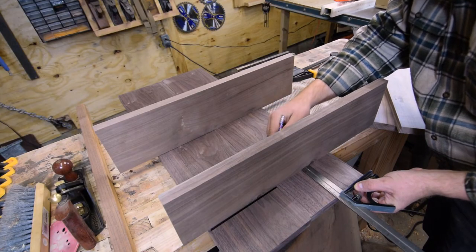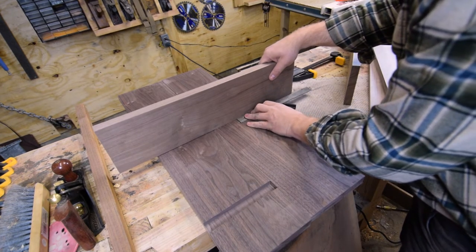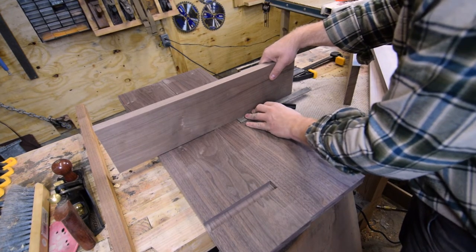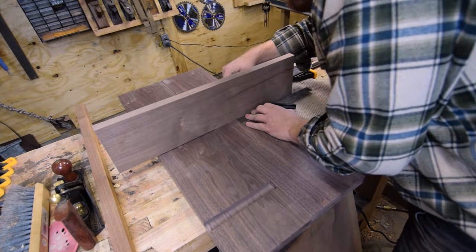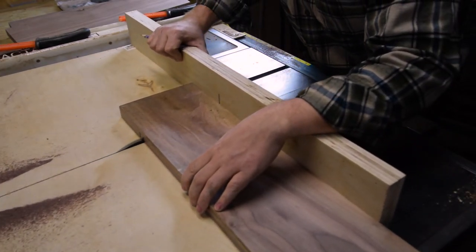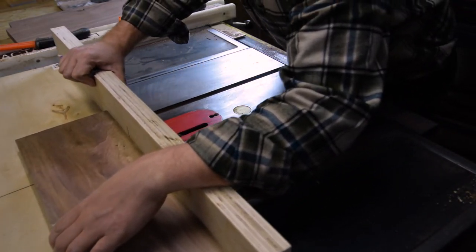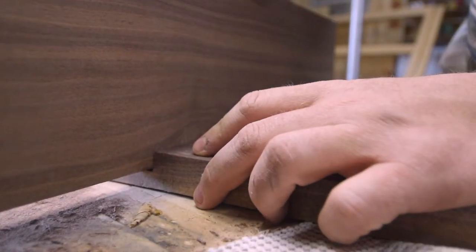The last step in assembling the Cloffice was assembling these Mark Spagnuolo-inspired shelves. I'm not going to come even close to explaining it as well as Mark did, so I'll link to his video here. I'll do my best to give you the Cliff Notes version though. The most important part of these shelves is to have accurate fitting dados. I did this by choosing to nibble away until I had a perfect fit.